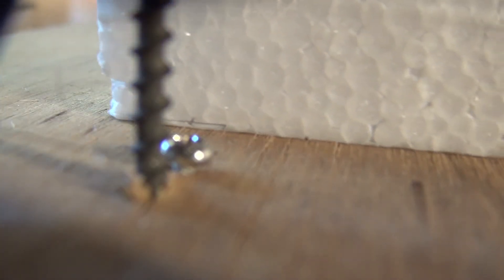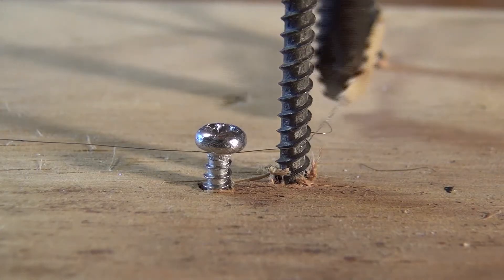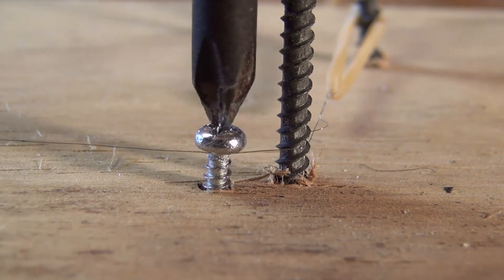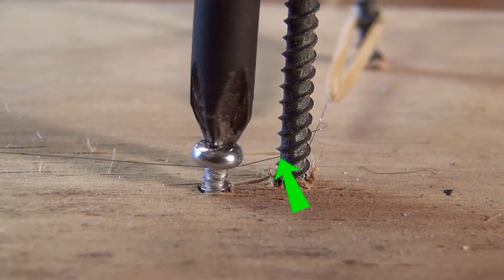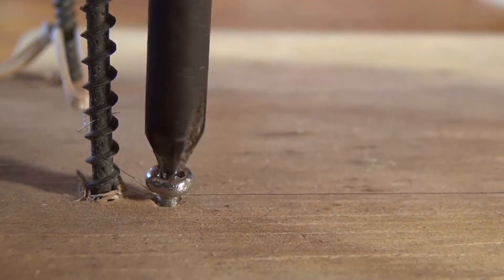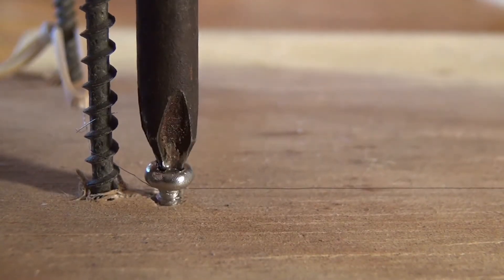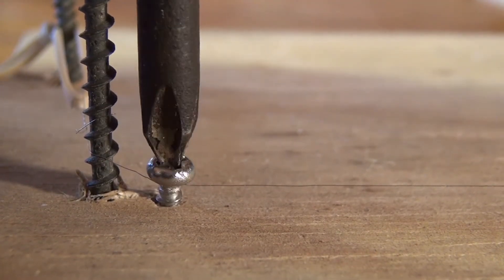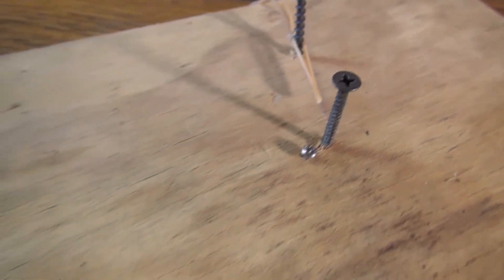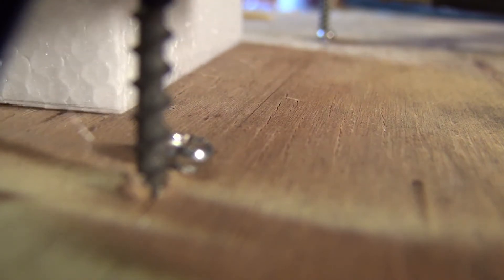A different strategy, even a bit more precise, is to add a screw that's flat on the bottom and usually has a round head on top. The wire is always a little higher on the outside screw. When you turn the inside screw, it places the wire very precisely to the right height, both down and up. As with all hot wire cutters, the resistance wire is kept under some pull tension — in this case rubber bands. I hook the car battery charger to the outside screws.